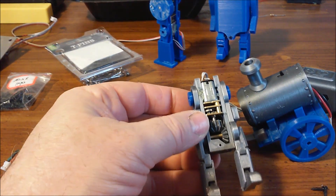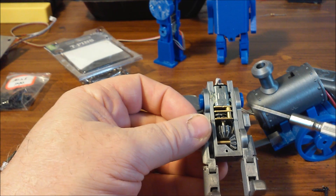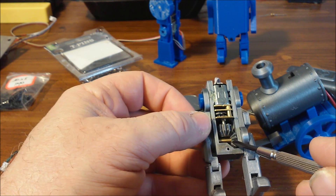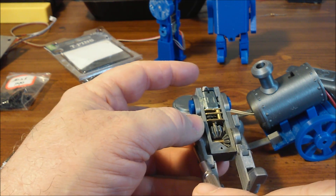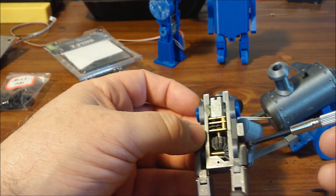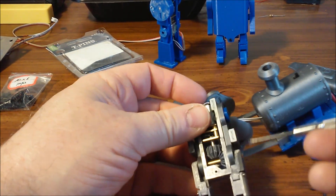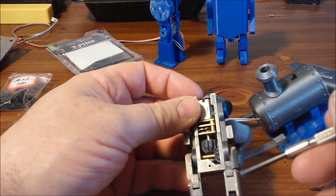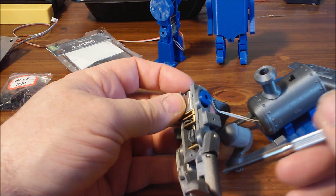The inside is pretty much the same as this other one. You have an N20 motor driving a bevel gear that drives another bevel gear hooked to a three millimeter, or one-eighth inch, shaft — it's 32 millimeters long from one side to the other. That shaft drives these little cranks that are offset — one up and one down in their orientation.